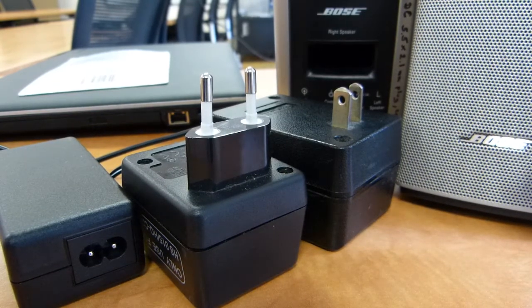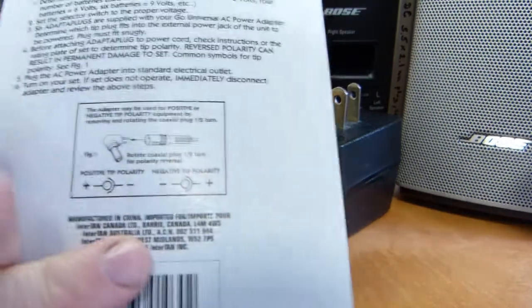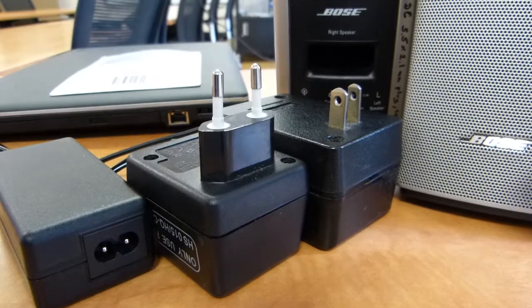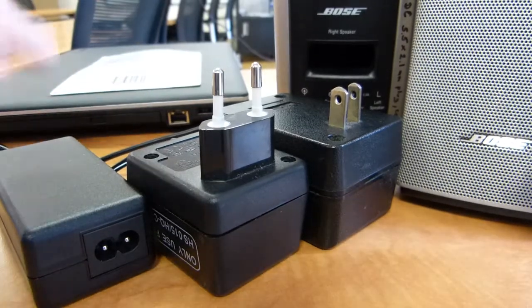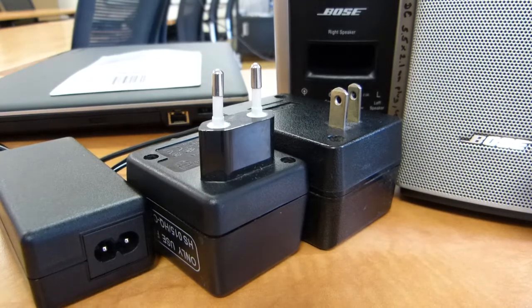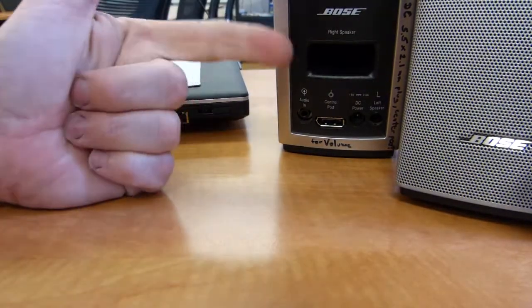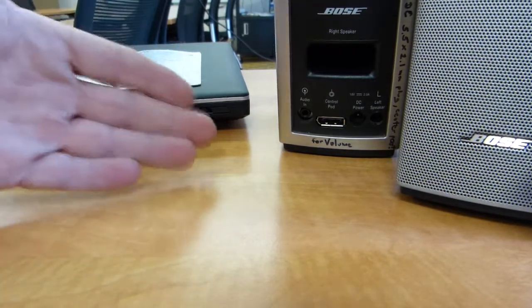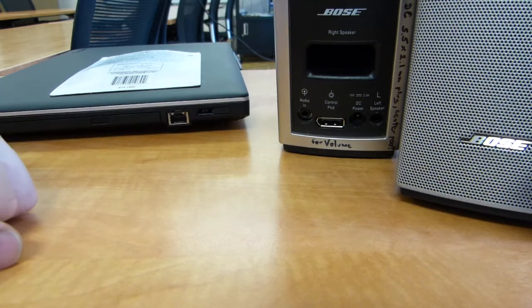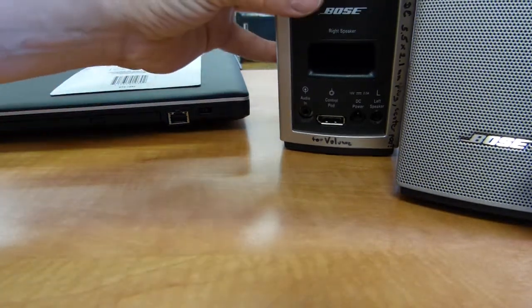If you ever have to experiment and your first guess doesn't power your unit, then you have to splice and reverse polarity, because the other configuration will power your unit successfully. That's why this splicing is important. So: volts, amps, polarity, end plug, wall plug. There are hundreds of ways this can go wrong or not match — it's quite a bit of footwork if you don't have the proper parts and part numbers, which happens because manufacturers may want you, explicitly or implicitly, just to buy another one and spend more money. Thank you very much for watching.